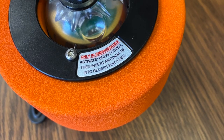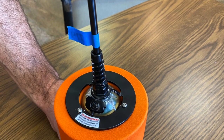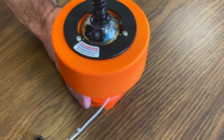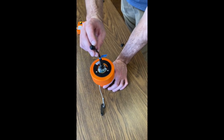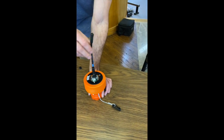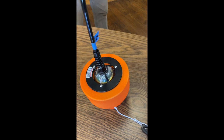There are no special storage requirements for this beacon, and maintenance consists of checking the self-test function periodically and replacing the battery. To use the built-in test feature, push the antenna tip into the test recess and hold for one second. Release after the light flashes.